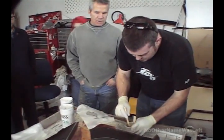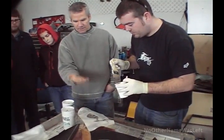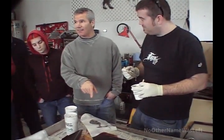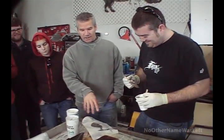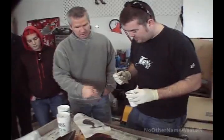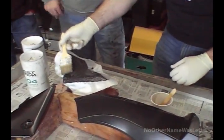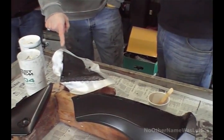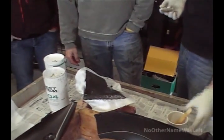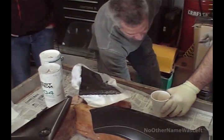You want to not be too generous with the epoxy. This is called wetting out — it's saturating. The nice thing about working with fiberglass is there's no question about where it's wetted out and where it's not — you can totally see it. That area is a little dry because it's not quite completely cleared. Now what you're going to see is a bunch of problems about to start happening. When he tries to get one side to go one way and the other side the other way, the tip is going to get a fold in it and it's not going to stay attached. So the relief cutting scissors come out and you make that problem go away.